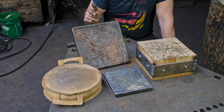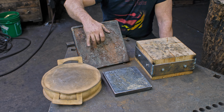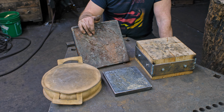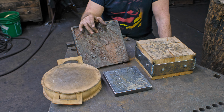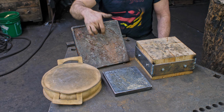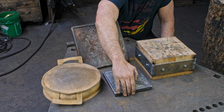So in the last video when I did the female figure, I did this using my pitch board. This is pine pitch here, and that was the backer that we used in traditional repoussé workings. When I got to the cuneiform and I'm working with essentially a flat panel, I needed something to be able to put those characters into the metal. I needed something with a more solid backing than the pitch. So what I made was this little lead board.